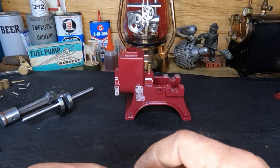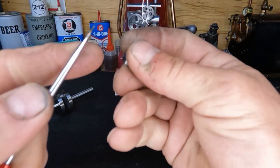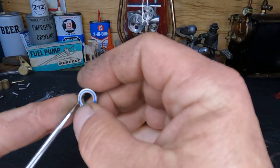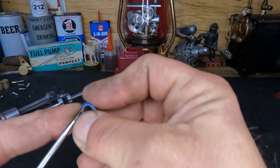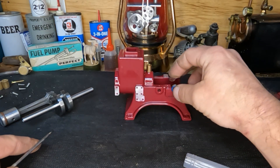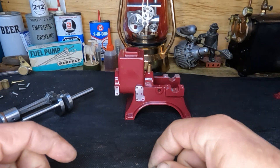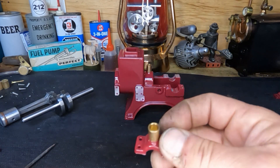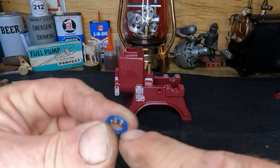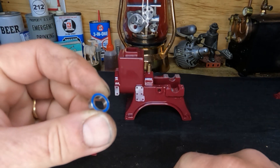I think tonight we're going to put our crank in. When it comes to these bearings — they're sealed rubber lip seals on both sides. We're going to pop the seal out of the inside of these because we're going to run four bearings: two in each part of the journal. That way we can still use our oil cups — oil will drop through the center, and the inside without a seal will let lube reach our main bearings.